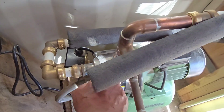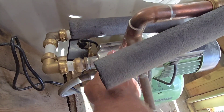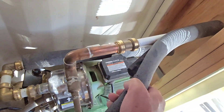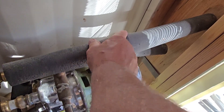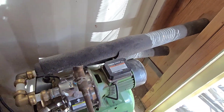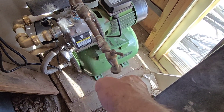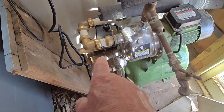This is the outlet up here — see, it says outlet right there. On your outlet you don't have any check valve; your stop or check valves are the faucets. So if I open this faucet and let it run into a bucket, the pump will come on as soon as the pressure drops just a little bit.